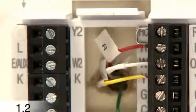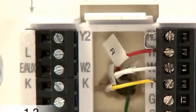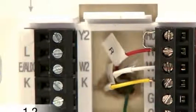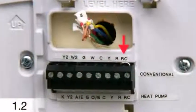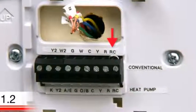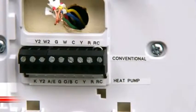When looking at your old thermostat, you may notice a wire known as a jumper wire. If you have a jumper wire, take note of which terminals it is connecting. Often, jumper wires will need to be transferred to your new thermostat for proper function. However, your Wi-Fi thermostat comes with a jumper wire connecting the R and RC terminals, which should be kept unless you have both R and RC wires. If you have both of these wires, you can remove the jumper wire from the new thermostat.